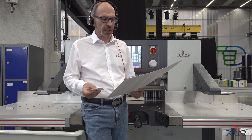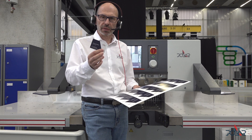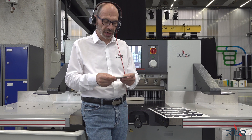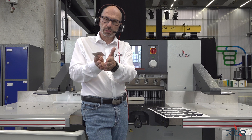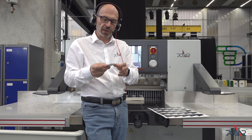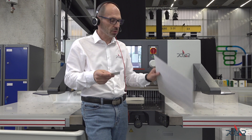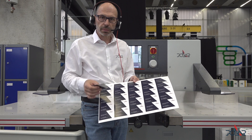In this video I will talk about counter cut. So what is a counter cut? When you cut carton like this business card, or even worse board, you will see that the cut quality in front of the knife is much more bad than behind the knife. The reason is simple: you have an angle on your blade and the blade is pushing everything away. In front of the knife, everything gets a little bit squeezed together. That's why the cut is much more rough in front of the knife than behind it. The goal to get the best possible quality from business cards would be to have all cuts behind the knife.